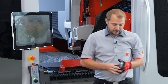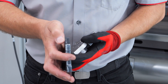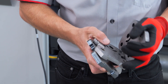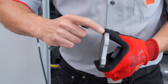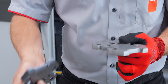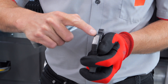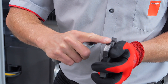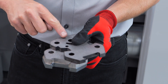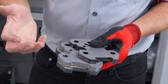Let's compare the three different process gases. First, oxygen cutting: there's a black oxide layer we have to remove for painting or welding, but it's beautiful with no burr — though really slow. Second, nitrogen cutting: a beautiful white edge, perfect for welding and painting, but it has a significant burr, although it's a lot faster than oxygen. Third, the mixed gas part: it is black, but this oxide layer doesn't come off so there's no problem for welding or painting. Compared to the nitrogen part, the burr is reduced a lot, especially in small corners and small contours — much better with mixed gas.